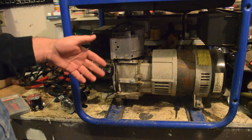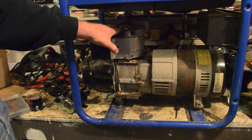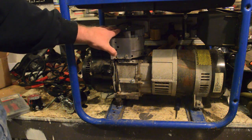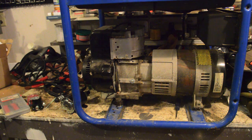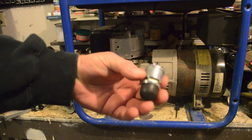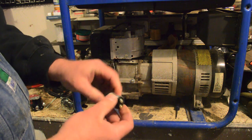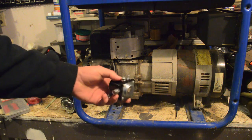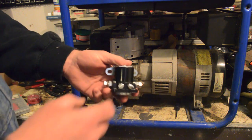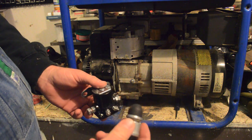But since this is backup power and I'm going to use it out camping or on the truck, I don't want to run it off 110 volts because I might not have it. You're going to need some sort of push switch — this one will actually handle the 12 volts and won't burn out — but mounting it is a problem. So I went down to the auto parts store and got the cheapest 12 volt solenoid they had. If you don't get a high amp switch, you're going to need a solenoid to keep from burning your switch out.